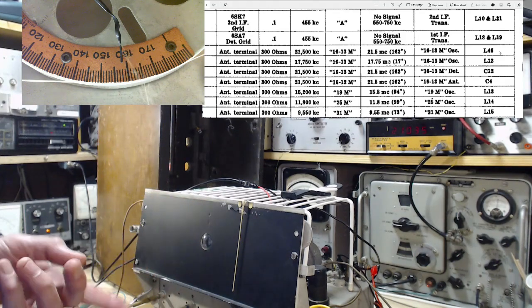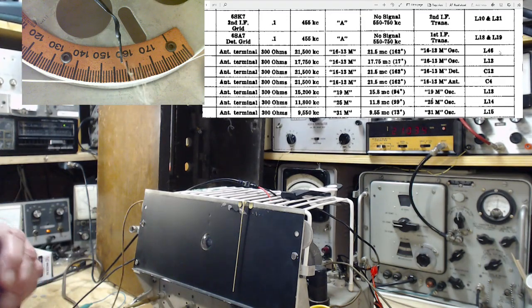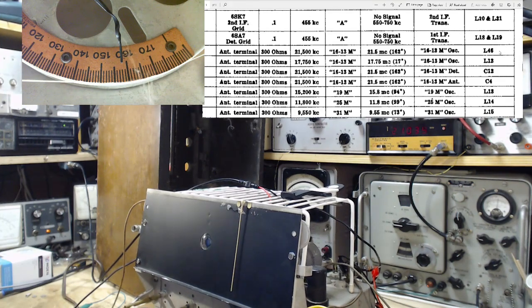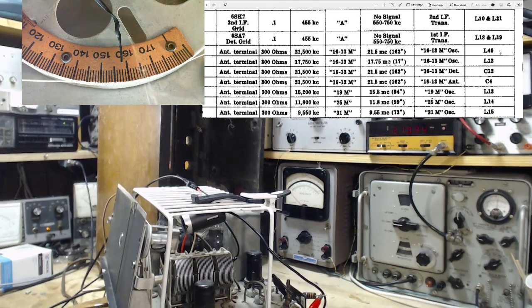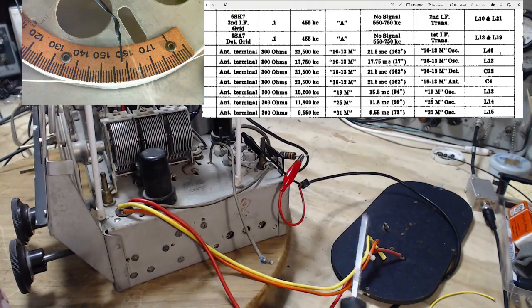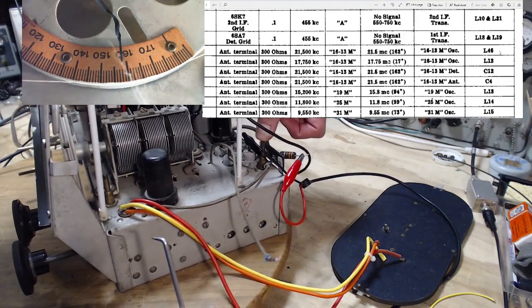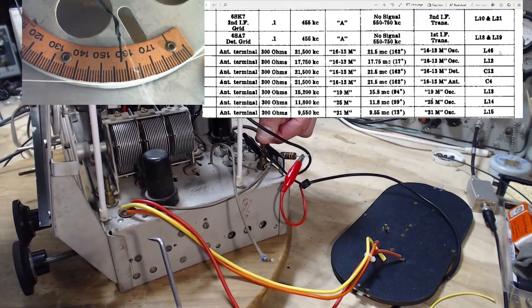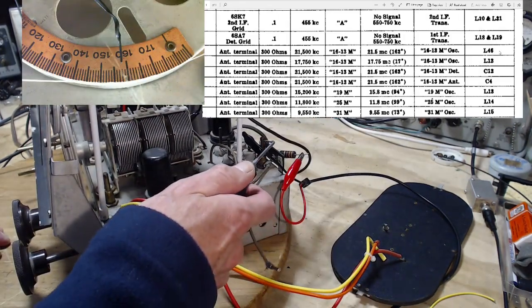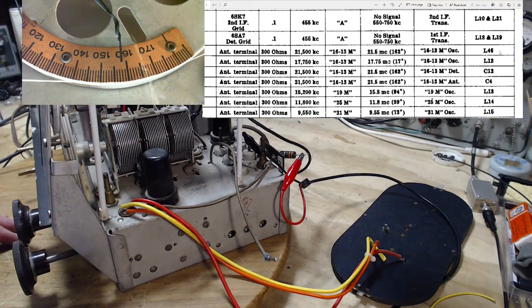Okay, so now we want to make the adjustment here on that capacitor. I don't like these kinds of capacitors to adjust, so I use this hook thing. Now there's a locking sleeve arrangement on this, which often is not locked, right down at the bottom here. Oh my gosh. I didn't touch anything. Definitely not locked. So the idea is this plunger goes up and down, and the capacitance changes. It's not on a thread or anything. It's just a matter of pushing it up and down.